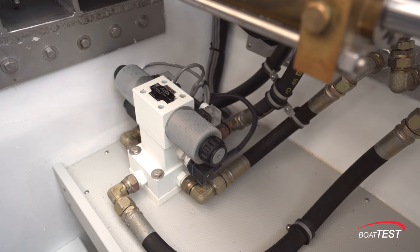To both quarters, large 14-inch cleats. Notice that the forward one is recessed so we aren't in the knee-strike zone. Large hawse holes with heavy-duty rollers. There's a warping winch. And look at the size of this deck drain — no problem with shipping water on this deck. Of course, all of this is repeated to the opposite side. Fire pulls are to the port side.